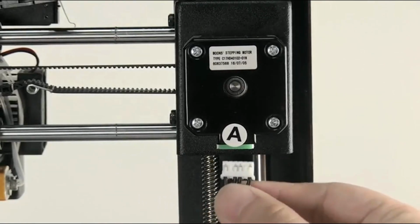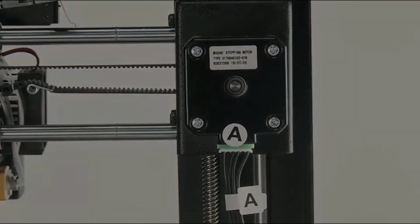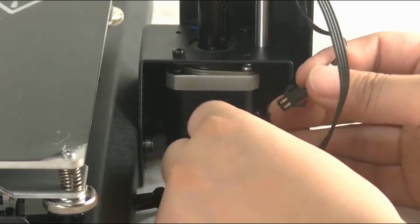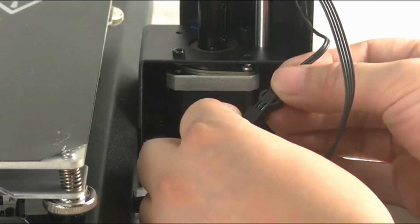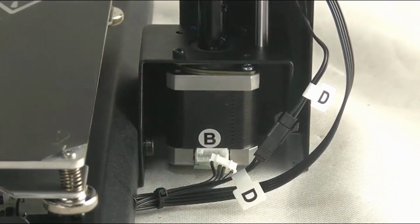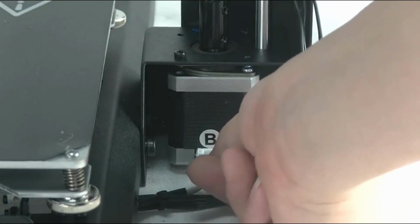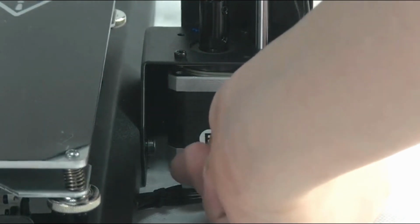Depending on the frequency of 3D printer usage, we recommend doing routine component checking once every month. Check each of the connector cables are still in place. These include 4 motor connectors, 3 stop connectors, and 2 fan connectors.